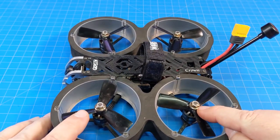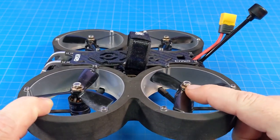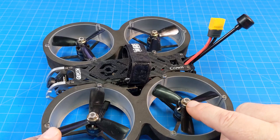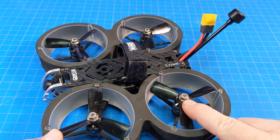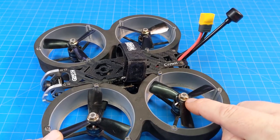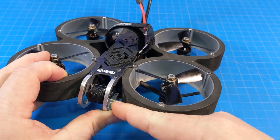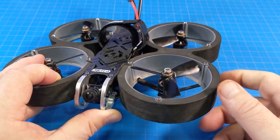A few details: if you lose a nut, there aren't any extras in the package. These are low-profile lock nuts with nylon inserts. If you lose one, you'll need to get another low-profile lock nut — otherwise you won't get the nylon far enough down and it's no longer a locking nut. Also, getting a hex tool in to make camera angle adjustments requires that bent hex tool. You can find those at stores if you misplace it, but don't throw it away right out of the box.